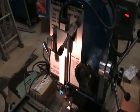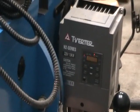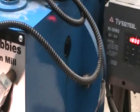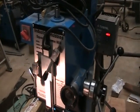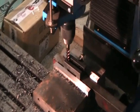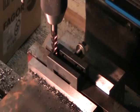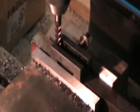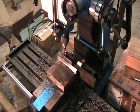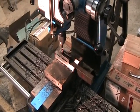Here is my Industrial Hobbies mill. I'm still actually setting this thing up. It's a variable frequency drive, three-phase motor, single-phase 220 in — a very nice device. For those of you out there looking at bench mills, this is a good device from Industrial Hobbies. I got mine with the vise, set it up with the end mill, and I'm going to start removing material and widening that gap up. I got everything true using a dial indicator. This device does have a power feed and DRO — I just haven't got all that set up yet. Make sure you get your workspace ready for these devices or they'll end up sitting on the pallet for a year.